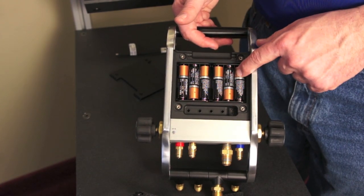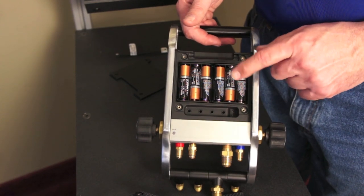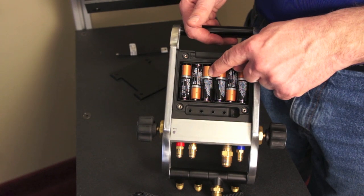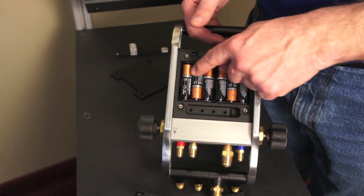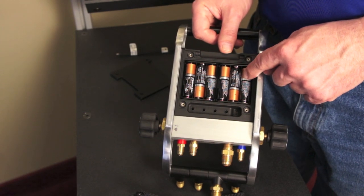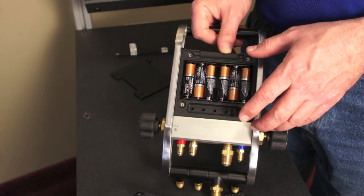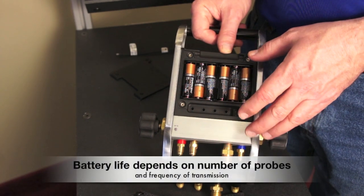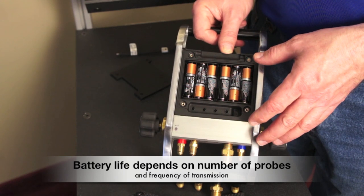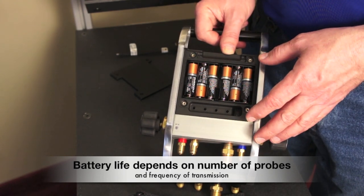In the back here, we're powered by six AA batteries — though the secret is it's actually only powered by three. The iManifold works off of 4.5 volts, and we connected two sets of batteries in parallel to increase battery life. With six batteries in there right now, we're running about 120 hours. After some power optimization we'll have a final figure, but right now it'll last you a good long time of testing.